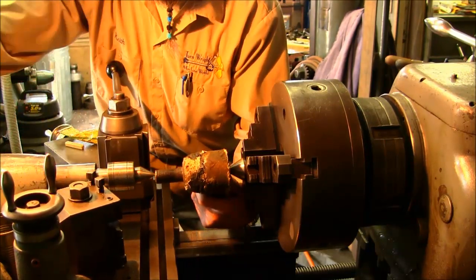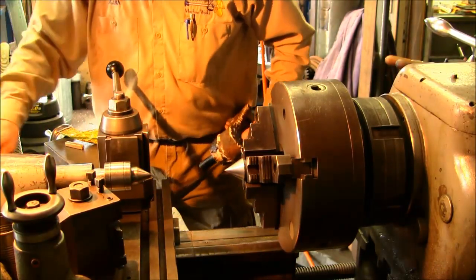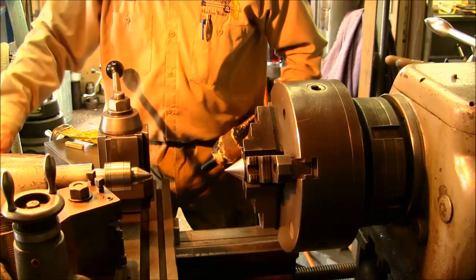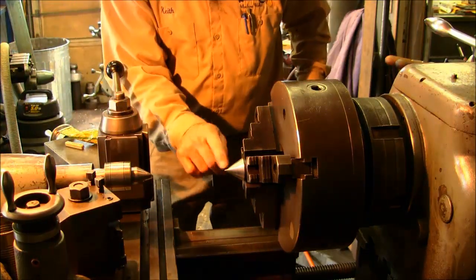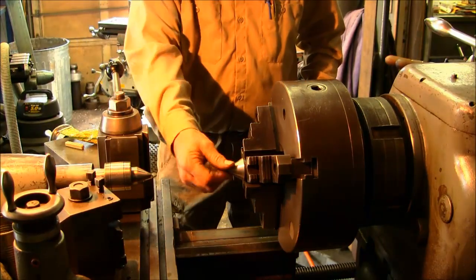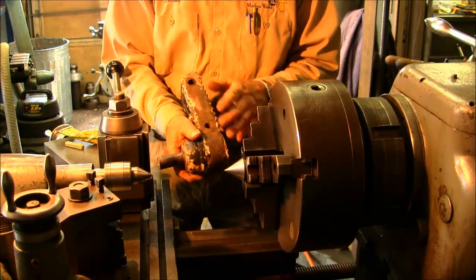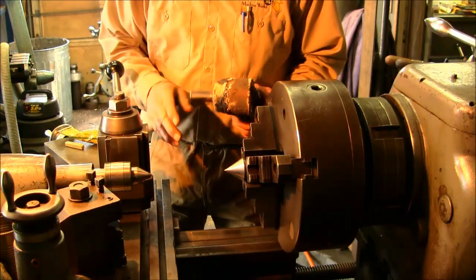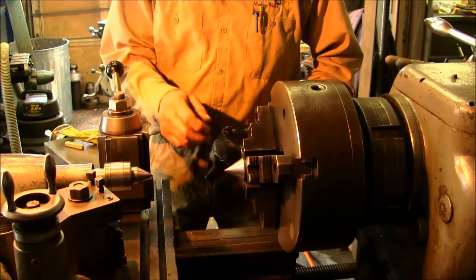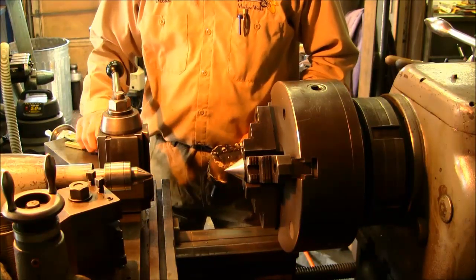All right. So we're going to go ahead and lock our tailstock semi-snug at that position there. Kind of play with it. All right. This is solid, and it doesn't spin. This spins with a chuck, and this drives, and this is going to be locked down with its rotation. And on a solid center to a center, you want to put extreme pressure lube.